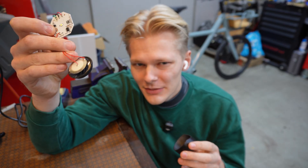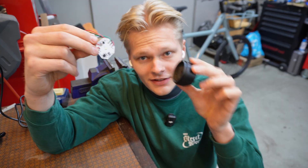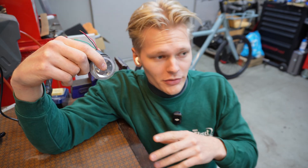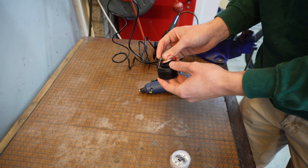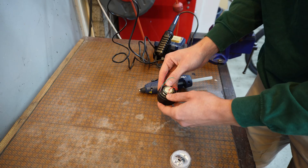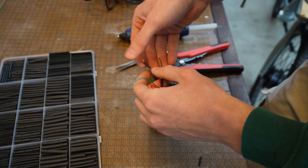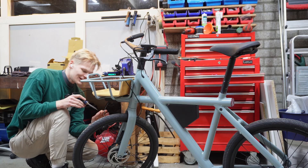This LED also has a little speaker attached to it — I'm not really sure if I'm going to keep it because it's a really annoying buzzer, and you probably just want a normal bell on the bike anyway. The LED can go into the 3D printed and painted case, and then on top goes the old lens carefully removed from the original light. The wiring goes inside the bike and it should be nice and bright, working really well instead of having the light underneath the basket. To mount everything inside the new parts I used hot glue — there are no really big forces on the internals anyway. The reason for a new LED is the voltage increase: the original can handle 9 volts, and my new one should work with the 36 volts the new controller is supplying. The red wire is positive for the buzzer, the green one is positive for the light, and the black wire is ground.